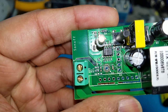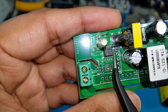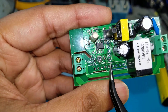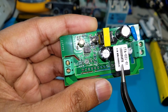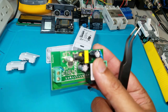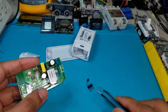Looking at the board itself, there are four pin holes used to flash the device. GPIO 14 is here, and the relay is on GPIO 12. We're going to change our sketch to GPIO 12. To flash this with the USB to TTL converter we need to hook the converter to these pins, so we're going to install 2.5 millimeter pin headers here.